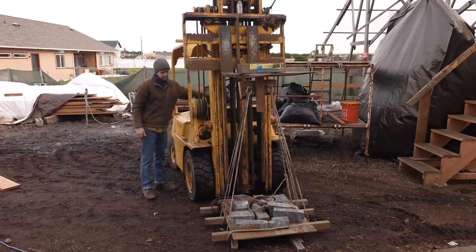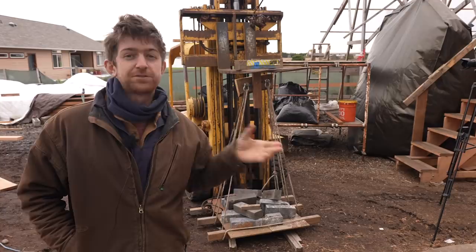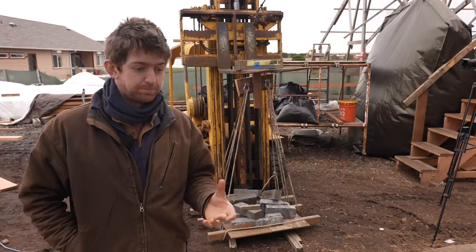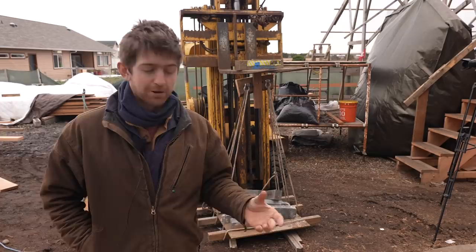So right now we are strength testing the copper rivets, and this is because they are fastening the floors to the frames, and I want to make sure that they're strong enough to make that connection, because those floors are really holding the weight of the keel timber and the ballast keel to the boat, so they have to have a nice strong connection to the frames themselves.